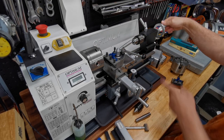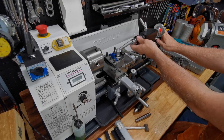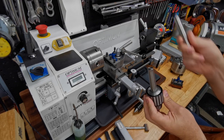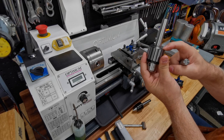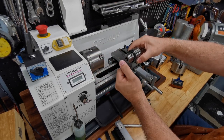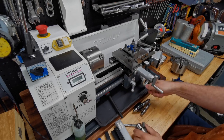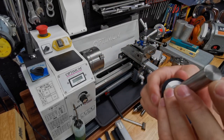Now the chuck is in there — I can wind this all the way to the zero mark and just past it, and there's not even half a turn left, so that one's cut just right. How did I cut it? These are very hard steel. I put it in the drill chuck, then put a big fat drill in the headstock chuck so everything was tight and accurate, set it spinning, and used a one-millimeter cutting disc on my mains-powered angle grinder. I just let it spin and slowly cut it — got a superb finish. Then I held some emery against it to clean it up.